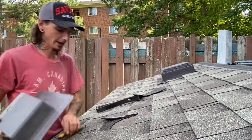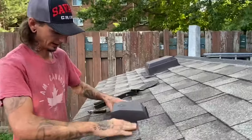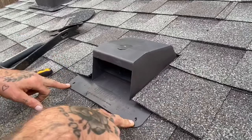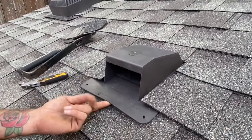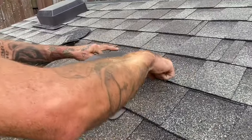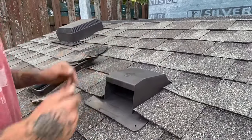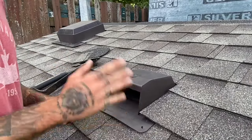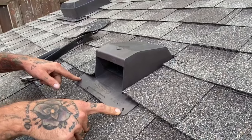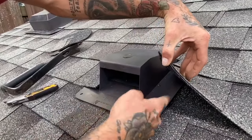Same concept as the other vent — make sure your tar comes up, vent slides in like so. Make sure it sits down flat. This one recommends two nails, it has two slots, but we always put three because over time this will start to curl up in the sun. So you put one nail and two on the sides — three nails in total. Then again, lift these shingles and nail under here. Some guys for extra precaution will take a bead of caulking and run caulking on the inside and across the back, because this is a penetration on your roof and an area that can cause leaks. We just nail them with grommeted screws so we don't have to rely on caulking on our nails, and we nail underneath these shingles on the nail lines, making sure our nails are behind the water flow channel.